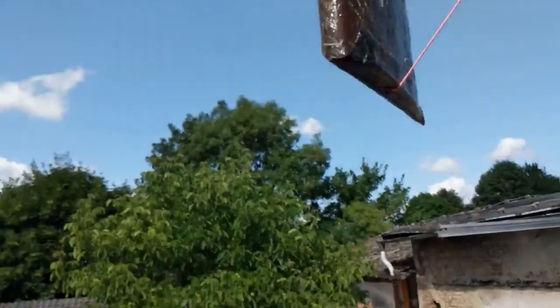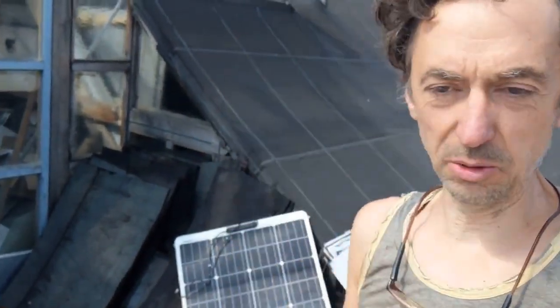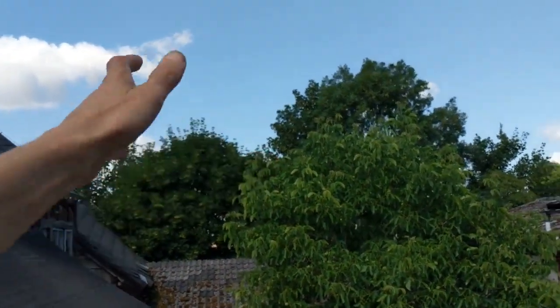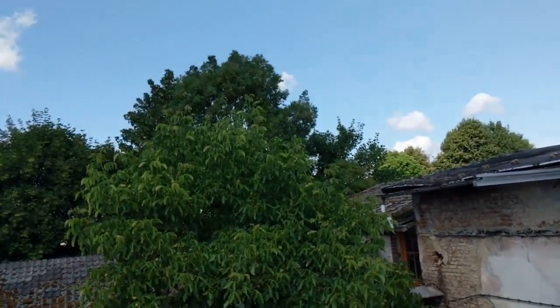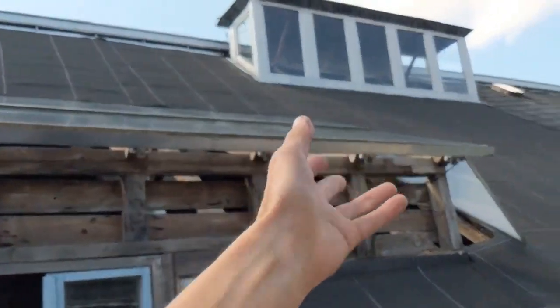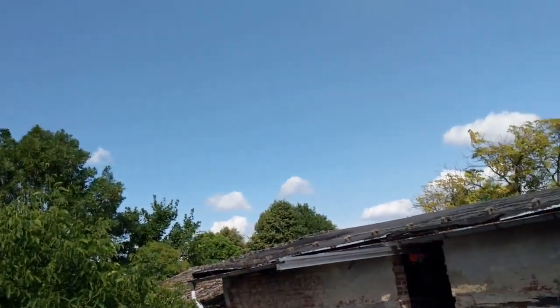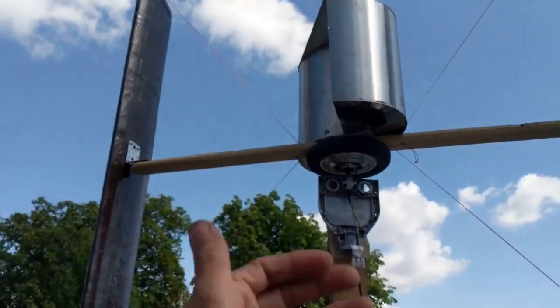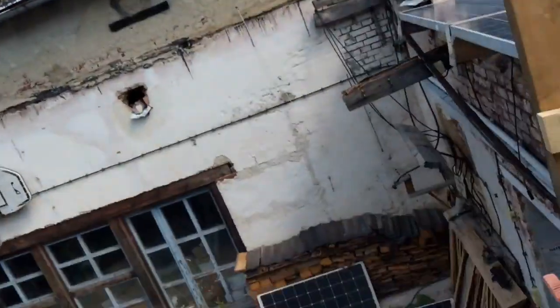With a fixed position, because I have this idea that in turbulent situations it's no good to make this with a wing in the rear — because it's mostly spinning out of the wind. Here it's always at the west; wind in this location mostly comes from the west. If it's coming from the south, then it's no good anyway. The wind channel is directing it to this position. So it might be better to make a fixed position and use the electric brake when storms come.